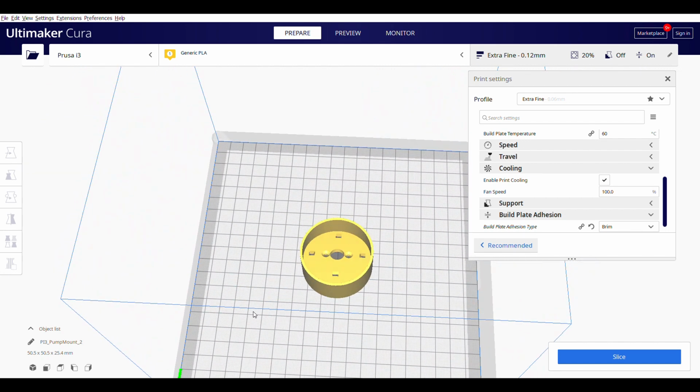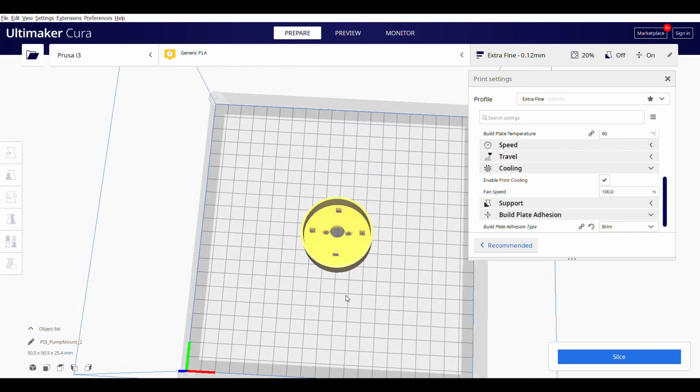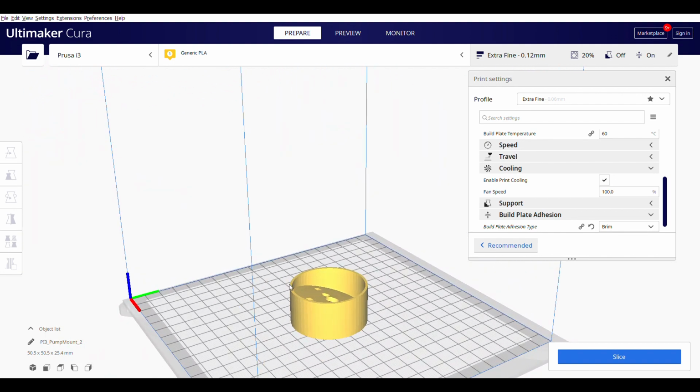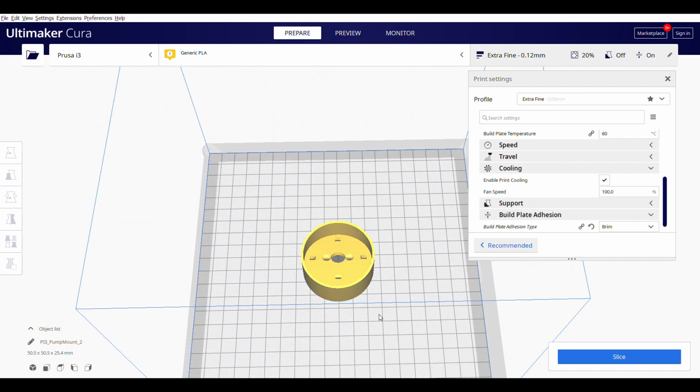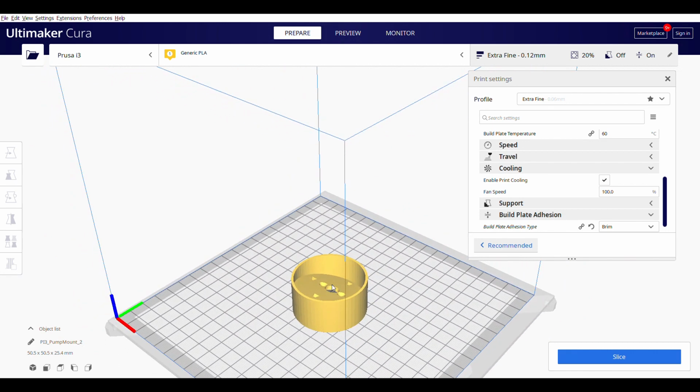It has a series of mounting holes for the motor for the pump, as well as the exterior 4 mounting holes for the pump itself. It clips onto those holes, and then it has central screw holes for the motor. And then you can see that it is a cylindrical shape, and so this allows it to not twist inside of the pipe, but remain at this angle. This angle has been hugely beneficial to making sure that the hoses that come off of this plate at a parallel don't end up getting kinked or bent too hard as they have to go to the exterior of the pump housing.